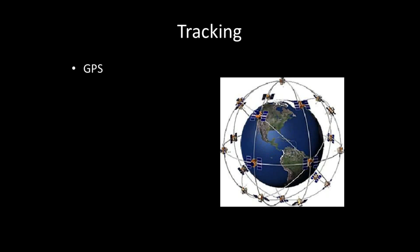The tracking system is going to be quite a complex project by itself. Obviously GPS is going to be key, but I'm going to be using a technology called APRS — Automatic Packet Reporting System — which is done over a radio frequency. APRS and the radio frequency it uses actually require a license in most countries. I recently got my amateur radio license last week, so I'm on track. You cannot put a cell phone in the payload using GSM or any cell phone technology because it is illegal per the FCC. If you plan on doing this, make sure you check all laws and regulations pertaining to communications and aviation.